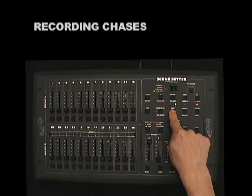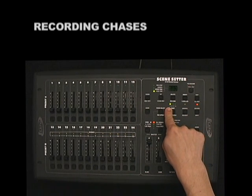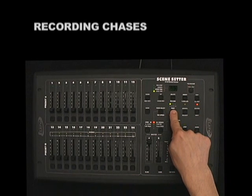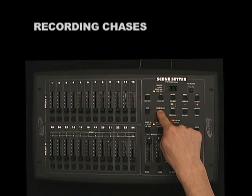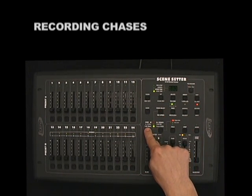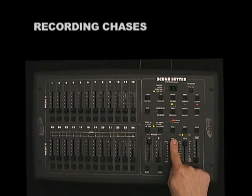Next, select the page where you wish to record your chase to. Page 1 contains pre-programmed chases, so unless you want to override those, select a different page. I'll select page 2. Set your mode select switch to the 1 through 24 or 1 through 48 single mode so that the green LED illuminates. Set your master faders, A and B, to 10. Set your fade fader to the instant setting.